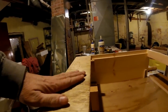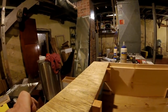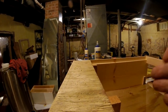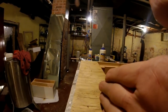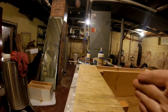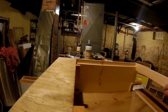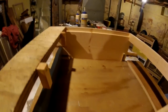I use 3/4 inch plywood, which is 3 3/4 inches long. The reason I use 3 3/4 inches is because we have the spacer. You're going to have another 3/4 inch board and another 3/4 inch board. So you need the space to move everything back so that your entrance is back here, to make everything fit correctly.